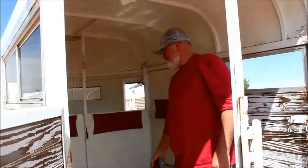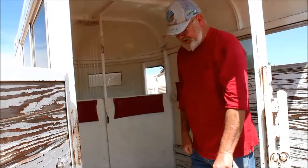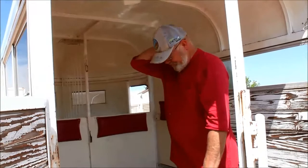We had to rewire it yesterday and today. I want to get it cleaned out and let it dry out really, really good. Then I'll go at these boards with a screwdriver — Phillips head. I can feel that they're overall solid, but if there are some real pithy areas and that screwdriver sinks right in, that board's got to go.